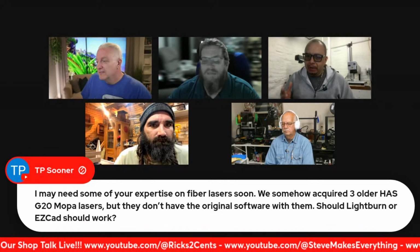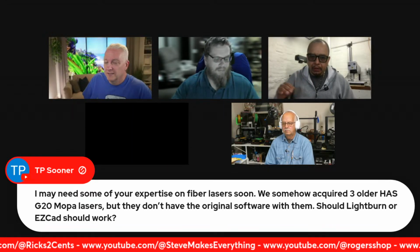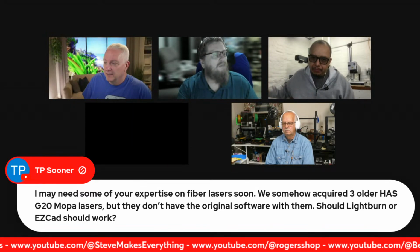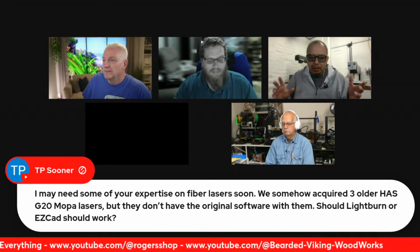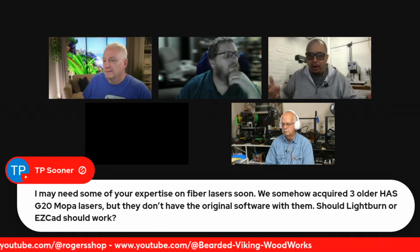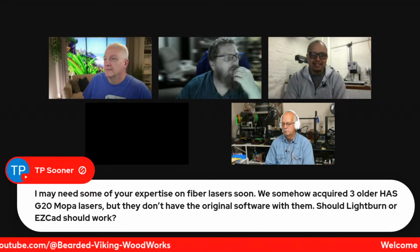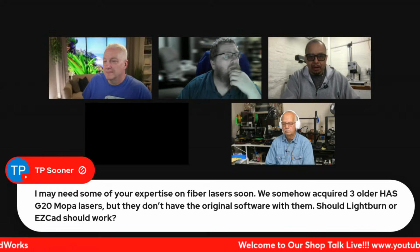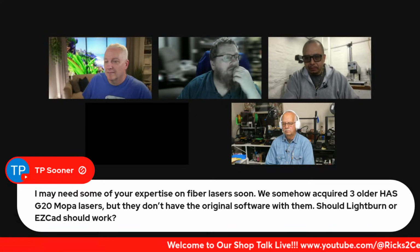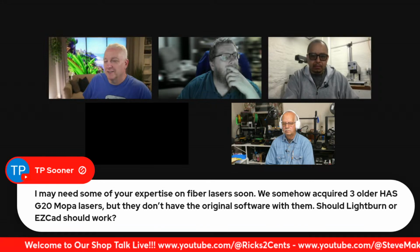And here's the other thing you got to remember: there's only like 4 manufacturers. Period. I don't care that there's 200 people selling them. They're all rebranded, and they may have little different cases, but when you plug it up and it auto detects, guess what? You know what it really is, right? So just have Lightburn auto detect. My com marker uses a JPT driver on Lightburn.